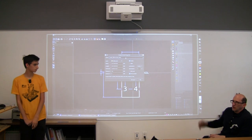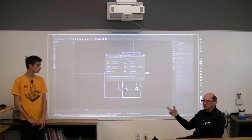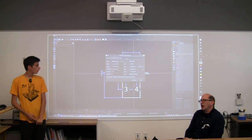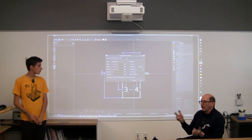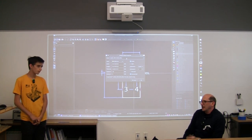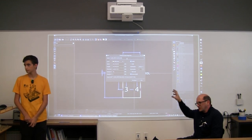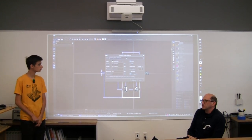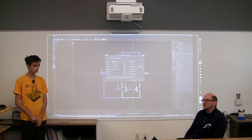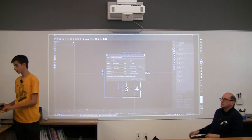Yeah, and also through DigiKey or Mouser, they have links to Ultra Librarian and SnapEDA, and those companies supply footprints. And you can also draw them. So if you can't find one, you can also use the tools for drawing your own footprints. We've done that a bunch on these boards; we've drawn our own. Did that answer your question?